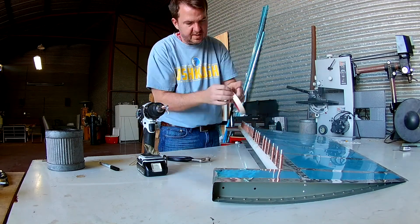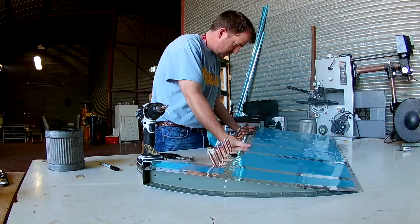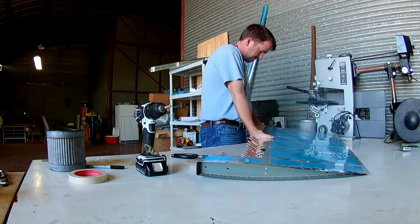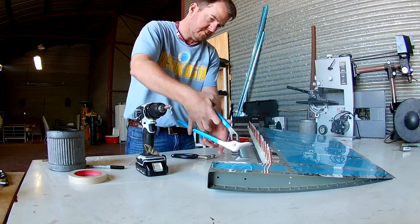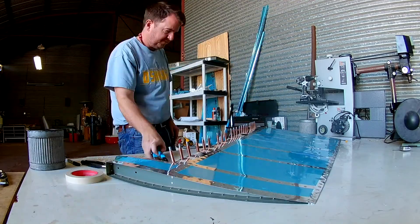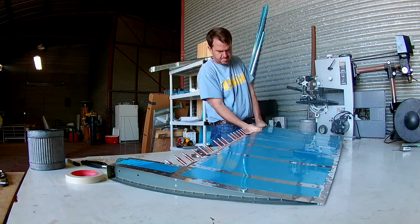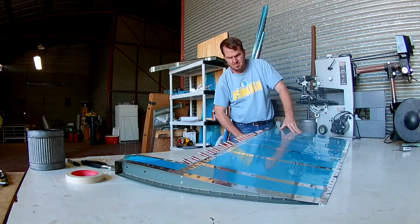What I did was I started with a piece of 1¼ inch PVC to kind of start giving it a gentle bend by bending it and holding it in place. One thing I realized is that the 1¼ inch PVC is just way too big. While the metal does wrap around the pipe nicely, it's too big of a radius to give any kind of generous bend.